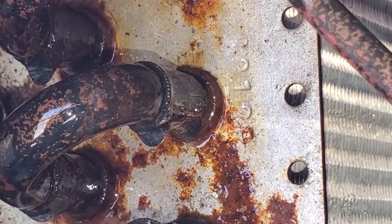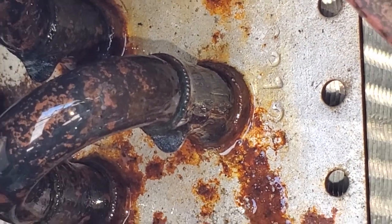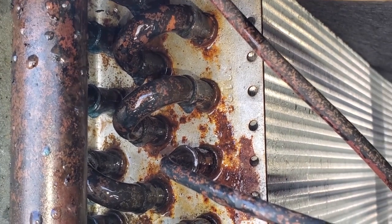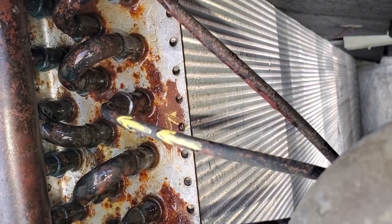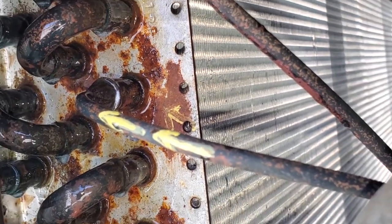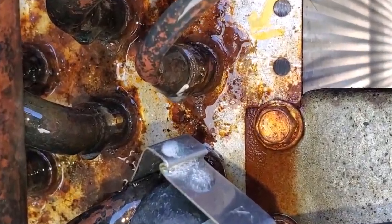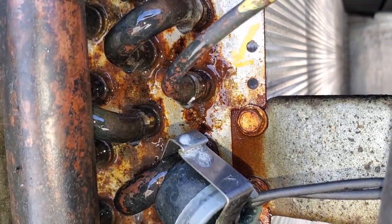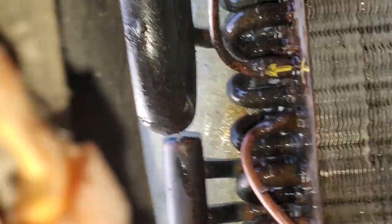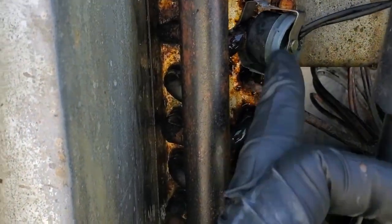What I'm going to do is just evaluate the situation and see how many leaks we have — that determines how we're going to repair this or quote to repair. I found a few more leaks. On this one there's a micro cluster right there, and I marked it with a yellow marker. Then dropping down to this one, there's another micro cluster of bubbles right there. Then we have the big one below that — that one's popping bubbles pretty big. So I found three leaks on this. They're all repairable, but I've got to evaluate everything and decide what's the best route to go.